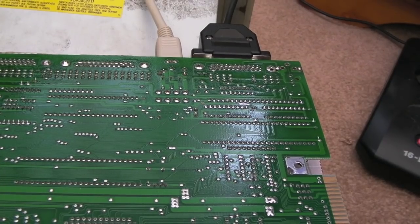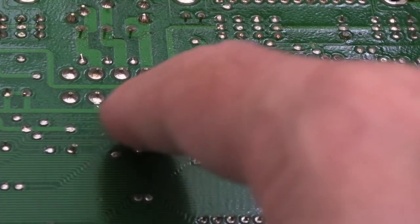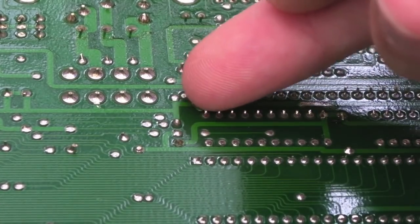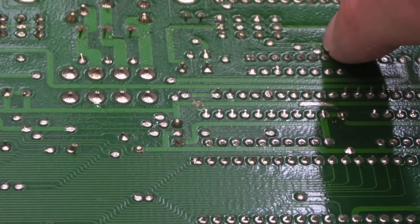This is super strange, let me just zoom you in. So our 5 volt rail comes out there — here it's been cut. There's a physical cut in the board there, and then there's a bit of solder here. So that is very odd to say the least. I think there's a break up here as well, the trace being cut there.